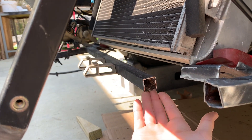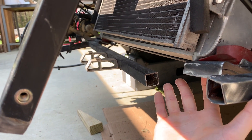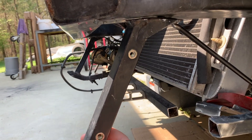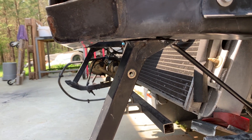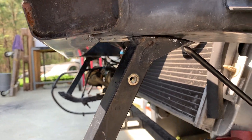This piece down here that connects the two sides is still kind of loose. That'll be tightened up once it's welded to this part here. This front mount — the rivnut — has kind of been yanked from the collision. So just a little tack weld there and we'll get that to sit how it should.